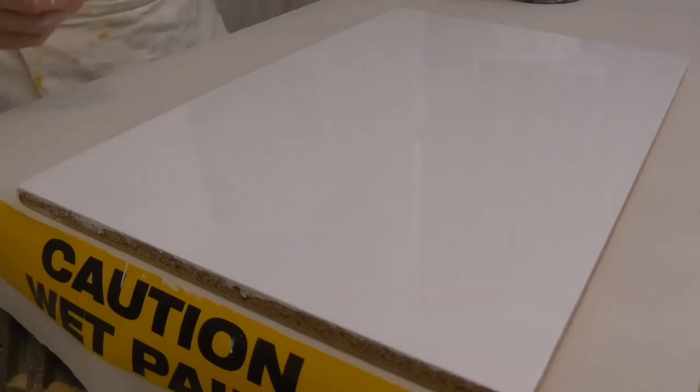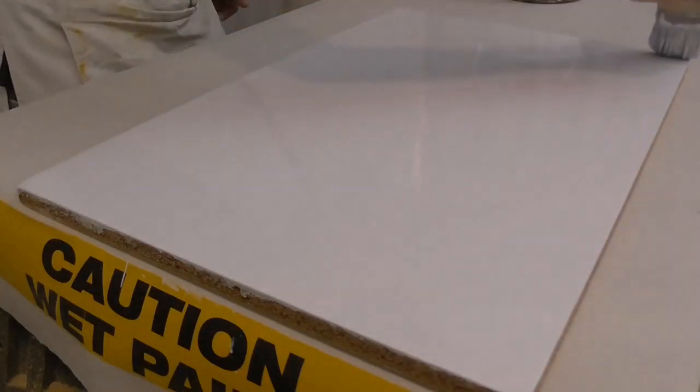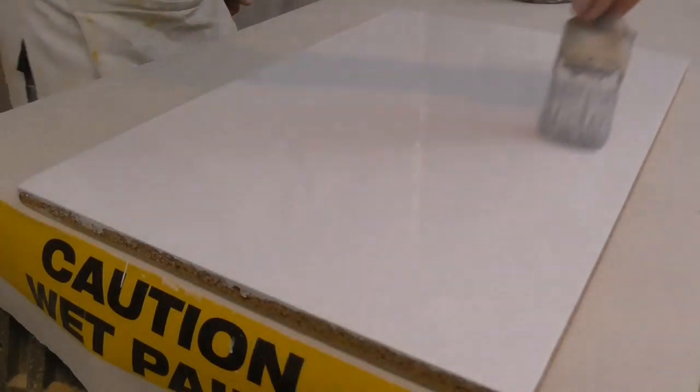There you have it. Not a bad finish that at all. Now, if I repeated that process again, undercoat and another gloss on top of that, it would be absolutely like glass. But at the minute, that's not too bad. You'll always have a few minutes to sort stuff out with your gloss. It's a lot better to use than water base.